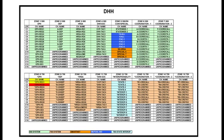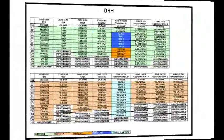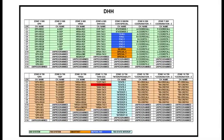Once you know this information, you can use it to make changing the zones to find the needed channels easier, especially with the Motorola radios. The main tip to remember is to change your radio to the same channel number as the one you need in the new zone before starting to change zones. Please watch the following demonstration. Pay close attention to this section.